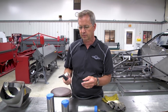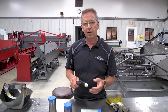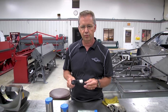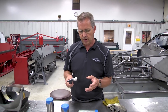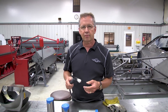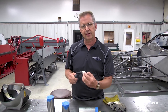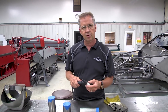If you guys want the same type of equipment that we use, you should probably give him a shout or send him a message on Instagram or however you want to communicate. It's not expensive, and I'm telling you it will make you a much better welder. If you have any skill at all with a TIG welder, adding this cup to your accessories will make you extremely good. You'll see right away how much better getting that extra shielding over the weld makes your weld quality. You can still get the Pyrex stuff - they've actually got a little stainless band around them now that keeps them protected a little better - but we really like these ceramic ones and we use them on all our welders here.